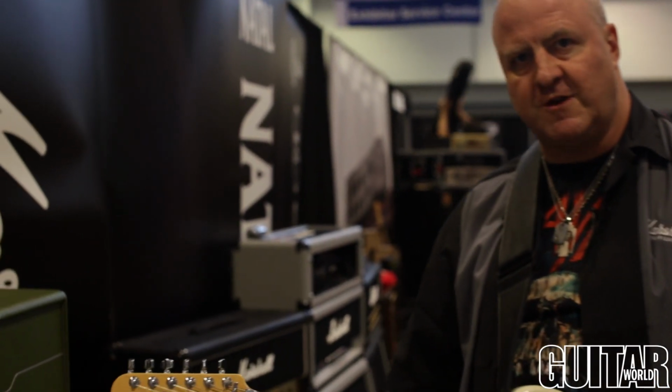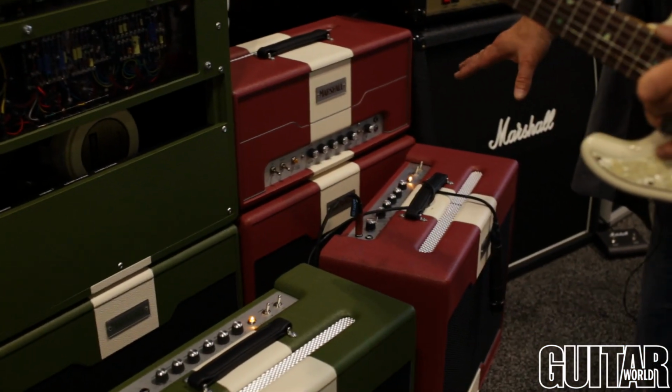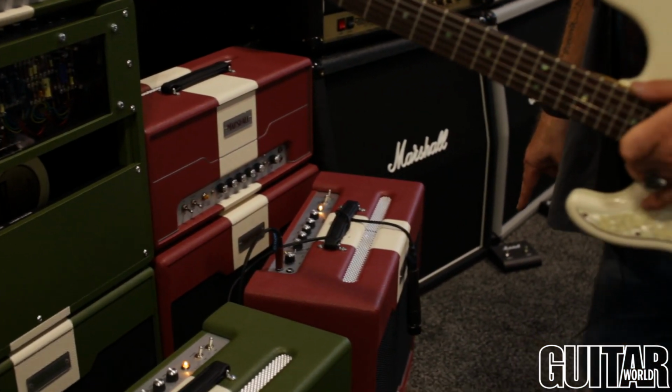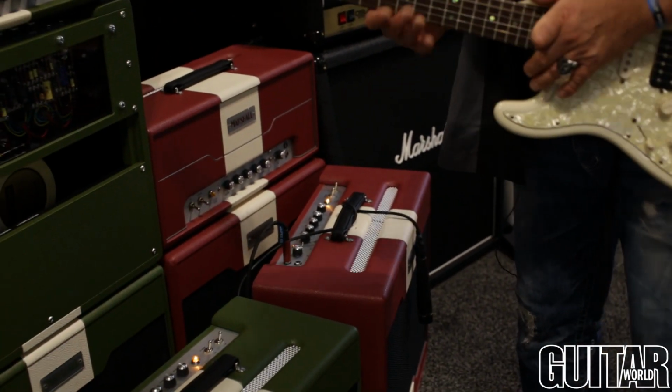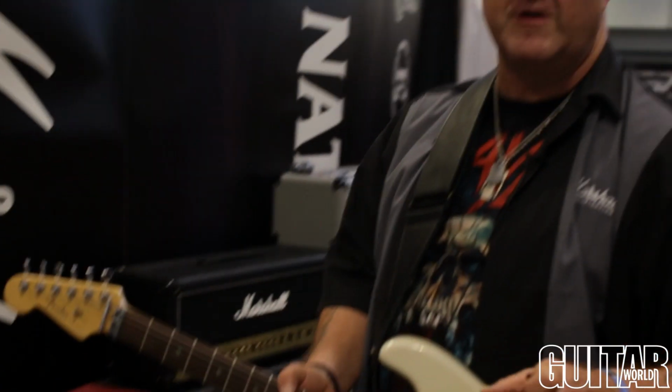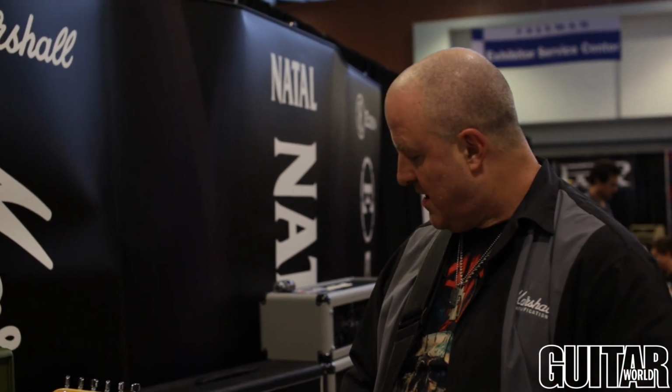When we move to the custom, which is the one I was just using, there's the extra tube because of the effects loop and a lot more gain, and there's a 20 dB boost, which is footswitchable. There's also a pull switch on the treble, which boosts the brightness from 4K up by 6 dB. There's also a body switch on the gain. When you pull it out, it boosts the bass by 8 dB from 120 Hertz down, so you get a lot more body.